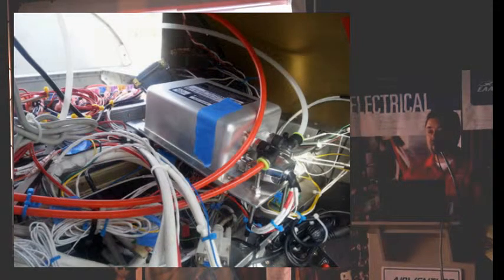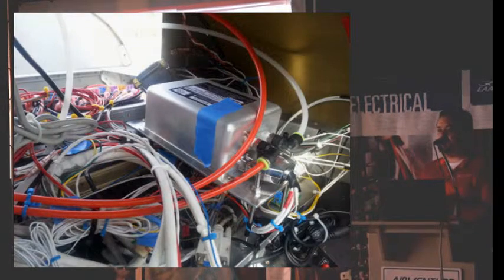The one thing that I've seen a lot of lately is that people are putting the magnetometers in the wrong direction, putting the connectors facing forward. In any of our systems that have the separate AHRS, both the AHRS and the magnetometer connectors should be pointed towards the rear of the airplane.